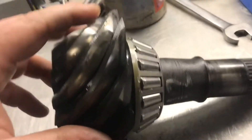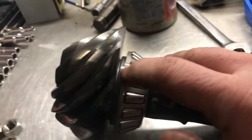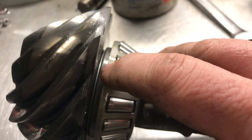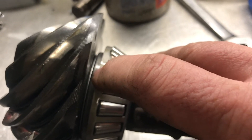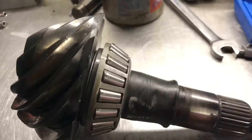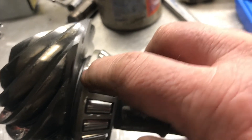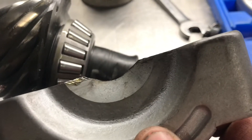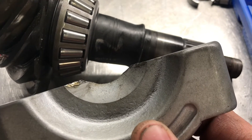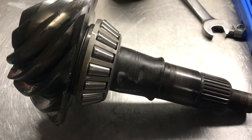Someone showed me a trick. You can see right there - that's the shim, the shiny part in there. I've got to get that out. My puller doesn't really do the job, but it can if I can make some space. What I'm going to do is put a two-by-four on the floor, put the gear on it, take a chisel, put it right in there and give it a couple good strikes. It'll move this bearing out just enough that I can get the puller in.